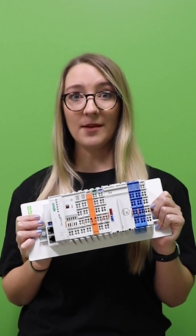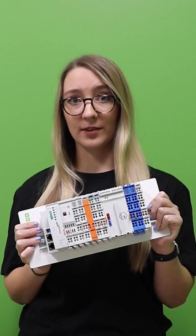We have several types of our Touch Panel 600. This is our all-in-one PLC and HMI. Wiring it to our 750 series I.O. coupler as the distributed I.O. for the touch panel provides a very compact footprint, reducing enclosure size.